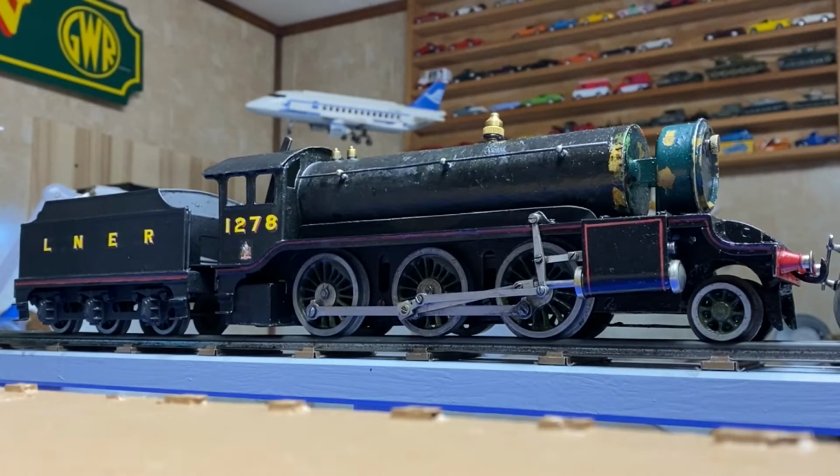In terms of the volume of the liquids for the engine, the original old antique instructions suggest 8 milliliters of oil, which is a teensy bit less than 1/3 of a fluid ounce. However, my engine runs better on 6 milliliters of oil. I find with 6, it wastes less oil at the beginning from spitting it out, and tends to start off initially when it's cold a little better, with a little less fuss. So instead of using 8 milliliters of oil, I use 6. Of course, that's me and my particular engine, which is old and worn, and I'm using AccuCraft steam oil, so you might have a different experience. Of course, you have to experiment and find out what works best for your particular engine.